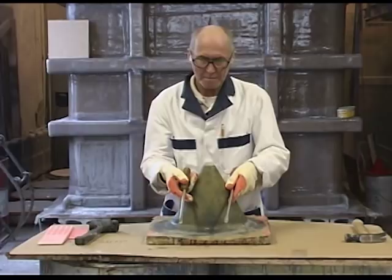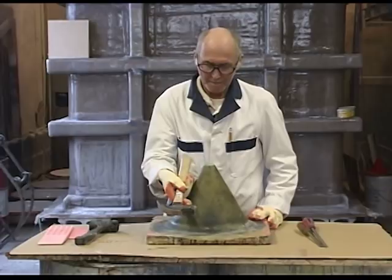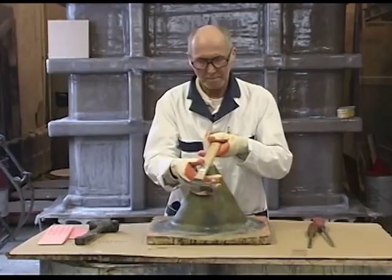One of the other tools you should never use for assisting your mold is a metal hammer. These may be great on the construction site, but for loosening up a fiberglass mold, they're not. That's an absolute no-no. If you hit a mold or a part hard enough, you'll star crack it, and you'll end up with another problem for repair. Always use the right tools.